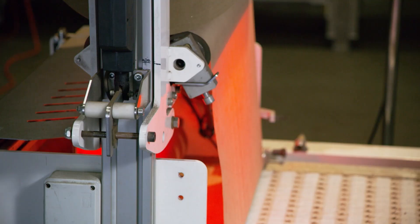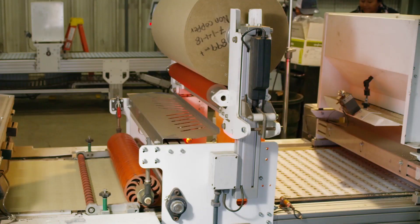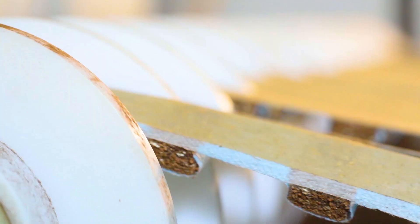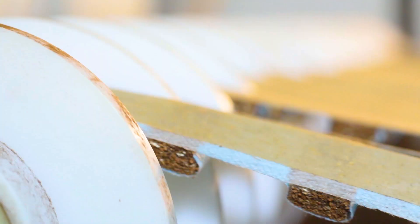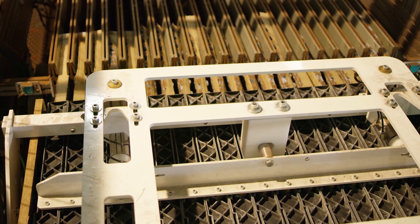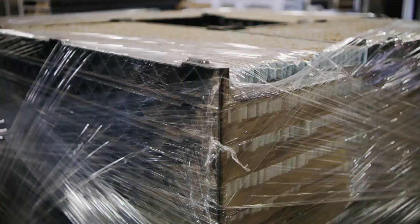Next, the top layer is applied and sealed to the seeded bottom layer tape, which secures the seed and completes the plant tape sowing process. The finished plant tape material is cut into 21 individual strips, which are stacked in an interlocking zigzag fashion to maximize plant density in the tray. Each tray contains 840 plants. Once finished, the completed trays are automatically stacked and delivered to the end of the sowing line.